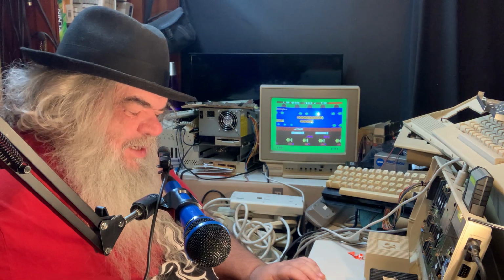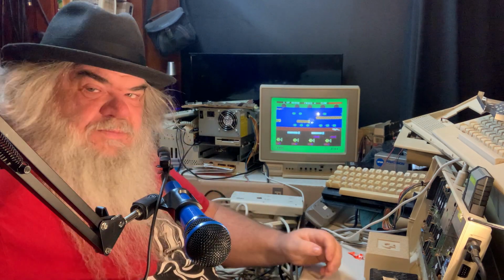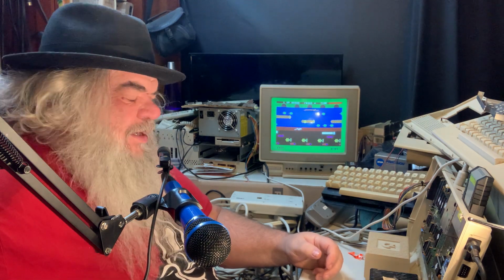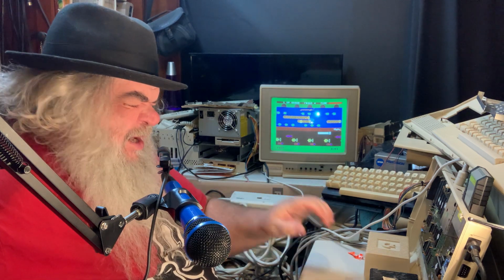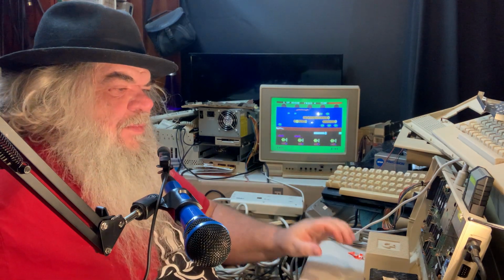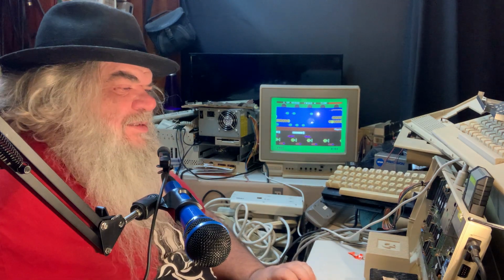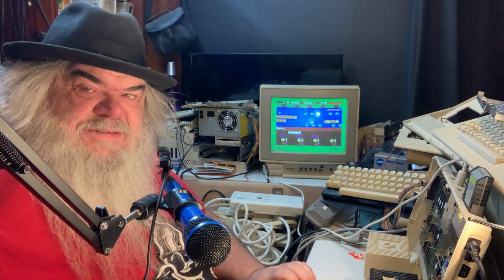But anyway, I have now done another one. And then, of course, the trace ripped. I was being so careful. Very annoying. Anyway, it will be fine. What I'd like to think is I will, I'm a little tired, put a socket into my board, and then I can test to see, is the 40-pin chip the culprit? And if it is, that's good.